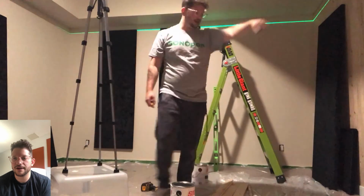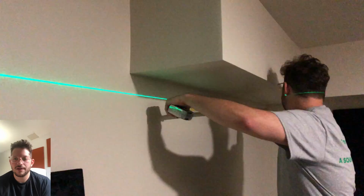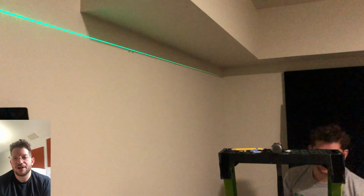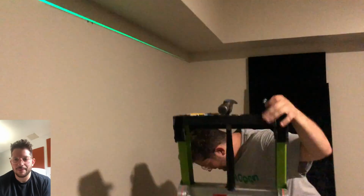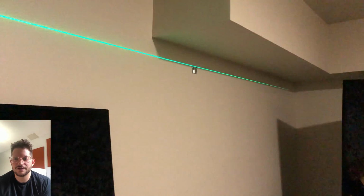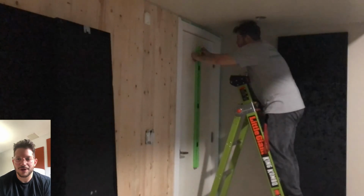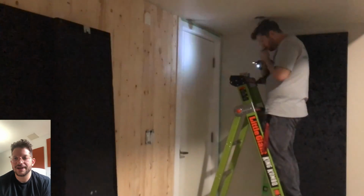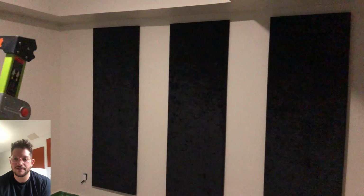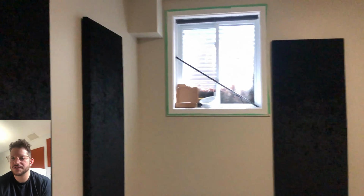We screw in our hanger, and then these panels are just simply hung up on the wall, and they're easy to level. And we have plenty of videos on the channel of our panel installation, but it's that simple. I'll link to the other ones in the video here, but yeah, just drywall anchors go into the wall, nail those in, screw in our flush mount hanger, and here we're adding another one to the door side as well, and we just added some Velcro at the bottom of that panel just to keep the panel nice and flush and not going to move on the door as it swings.